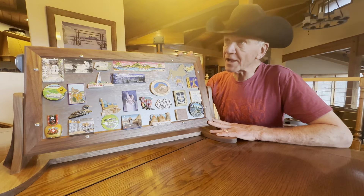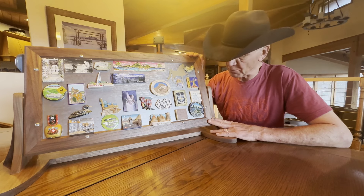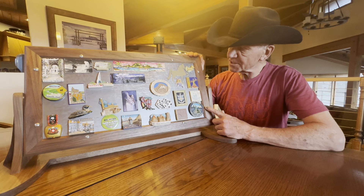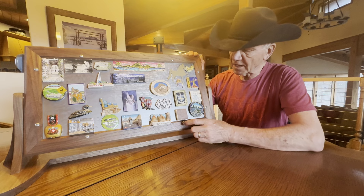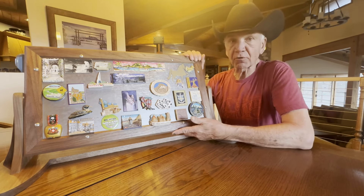This video will not go over every detail on the build, but I'm going to go over the key things. There are a couple of unusual features to it. One is that the steel plate is actually held in some slots — I cut slots all around this frame and the steel plate is held in with six bolts, so it makes it very strong.